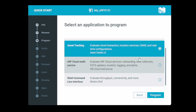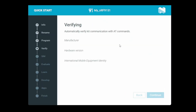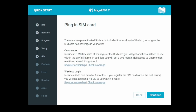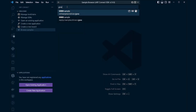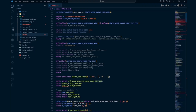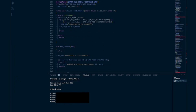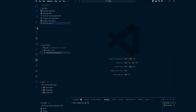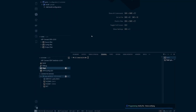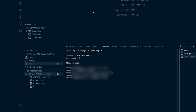Next, rename the device and proceed with the subsequent flash step. Then, after inserting the provided nano SIM card, provision it and ensure there's cellular connectivity. We're now free to flash a sample application. After opening VS Code and installing the NRF Connect extension, open the welcome window and click Browse Samples. In this case, we're going with the GNSS demo, which will allow the board to lock onto GPS satellites and return coordinate strings upon a successful lock. Add a new build configuration on the left while using the default values before clicking Build Configuration. Once it's built, simply click Flash to load the firmware onto your connected NRF9151. Output can be viewed after selecting the device and opening the first virtual serial port.